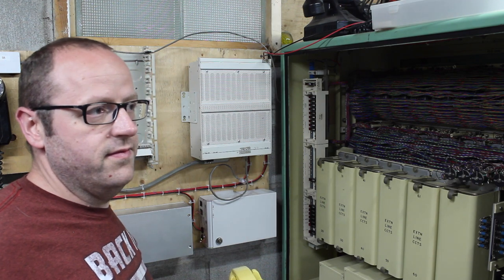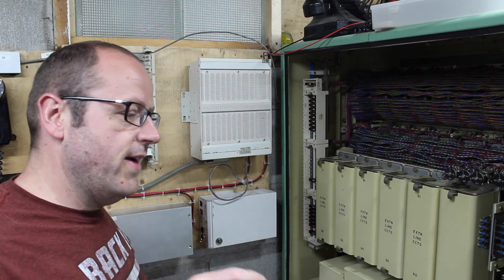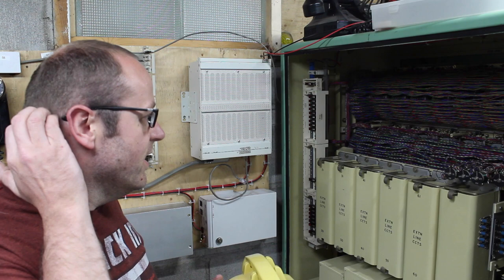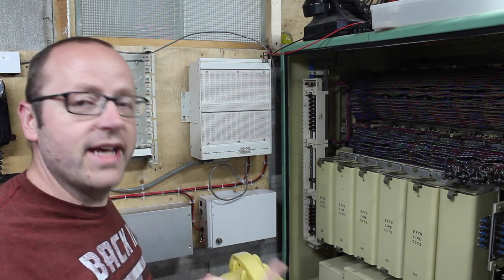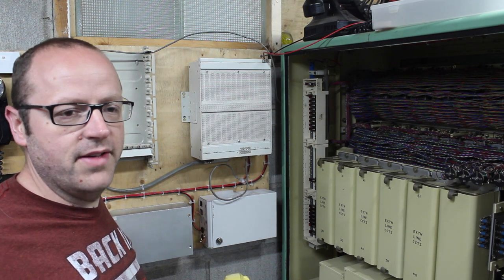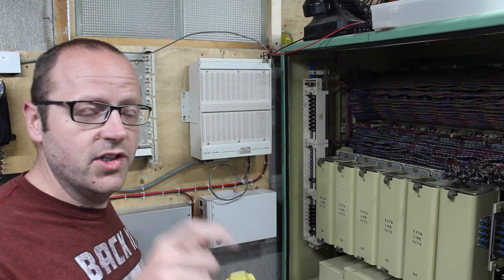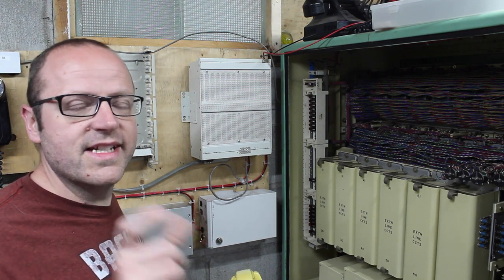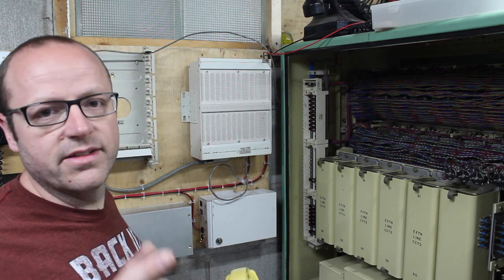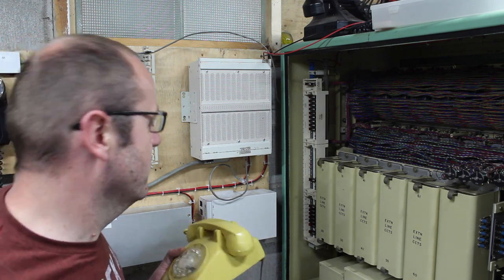So if you take 25 divided by 2, because there's 25 poles on a section, that's 12 and a half. So every 12 and a half seconds, you'll notice the cadence is messed up. But because it's two banks of contacts, they spread it around. So there's actually 12 and a half seconds and then a second and a half long tone, and then 12 and a half seconds and then a second and a half long silent period. A busy signal should be 1 second on, 1 second off, but it doesn't fit on the interrupter the way it's wired. So anyway, that's kind of neat.